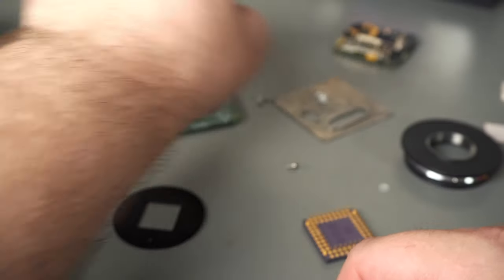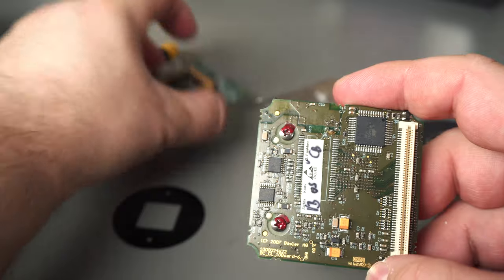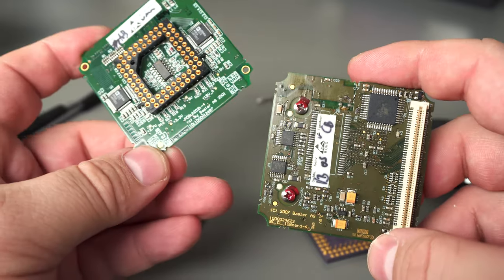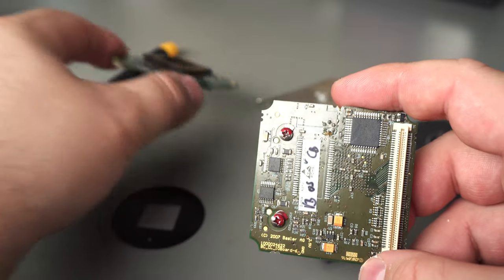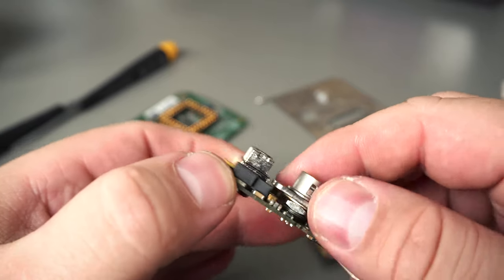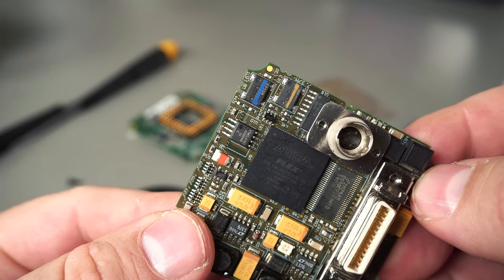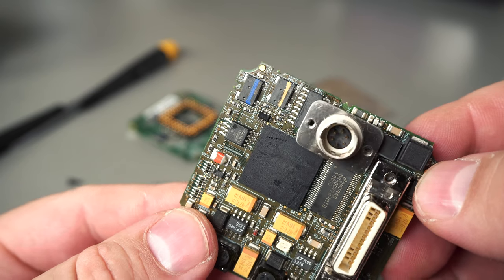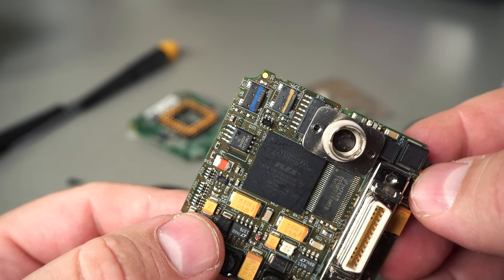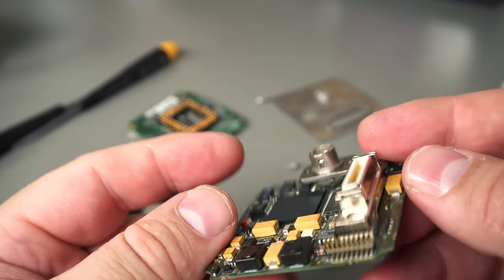You can see it actually uses a 15 volt rail. This whole unit is supplied by a 12 volt power supply under normal circumstances. This carrier board is dated 2001 and the processing board is 2007 — a much older design, which makes sense since you're not going to change too much on that. There's a heavy duty connector screwed into the motherboard with some Loctite. It's actually not an FPGA — it's a PLD, the Altera Flex EPF 10K, specifically the 50 version, the highest capacity, with 50,000 gates. There's pretty much just power and a little Atmel chip, which will be the flash holding the PLD software.